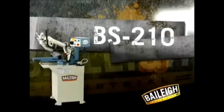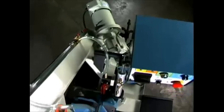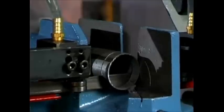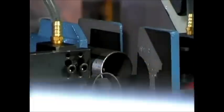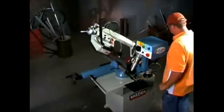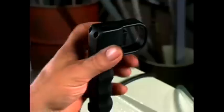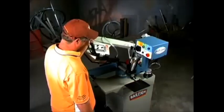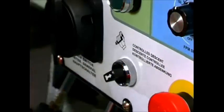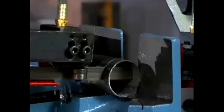The BS210 is a 110-volt band saw with a 1.5 horsepower motor and an impressive six and three-quarter inch capacity. Dual descent gives you the option of manual or hydraulic downfeed. For manual cutting, simply engage a counterbalance spring and control blade descent from the trigger switch — great for those one-off cuts. To go hydraulic, disengage the counterbalance spring and control blade descent with the hydraulic feed device, perfect for repeatable cutting.